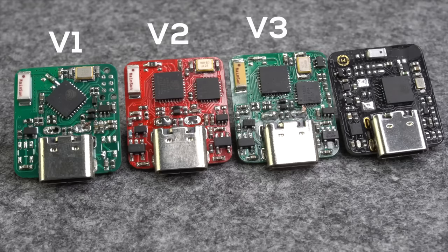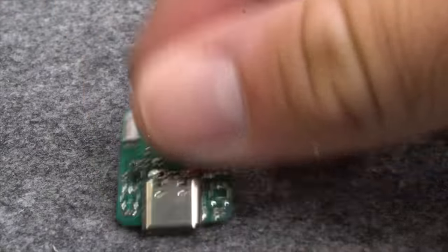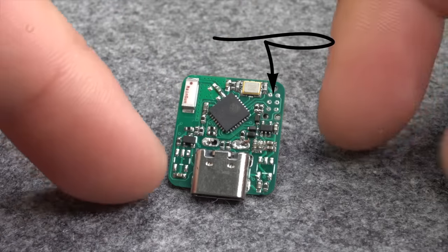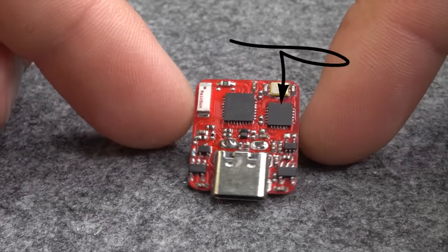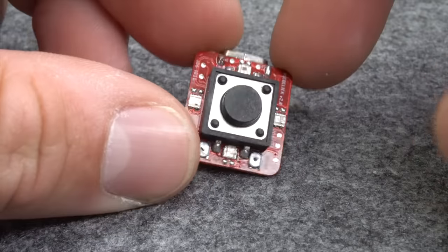the first version of the Picoclick. Back then, the USB Type-C connector was only for charging the battery and not for programming the ESP8285. To program it, I had to use a pogo pin adapter and a USB to serial bridge. The next version included that bridge on the device itself and used two buttons on the front to enable the programming mode and perform a reset.